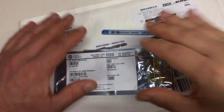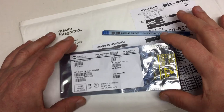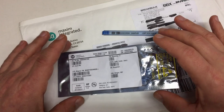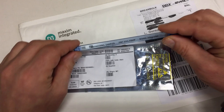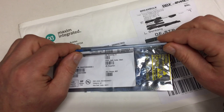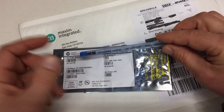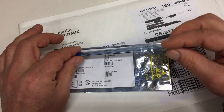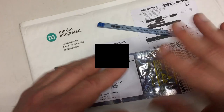You might remember that little Chinese MAX31855K breakout board I got that didn't work as expected — the internet wisdom was that it probably contains a fake chip. There's a card and link in the description to that video. Now I have original Maxim engineering samples of that chip, so we can compare the markings and compare the functionality to determine if it's really fake chips on these little breakout boards, or maybe there's a design flaw. There's no listing for this — not everybody can simply order samples from Maxim; you need at least a company address or something like that.